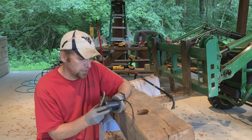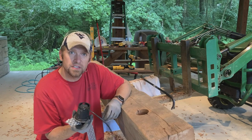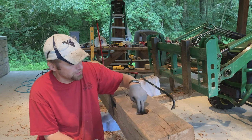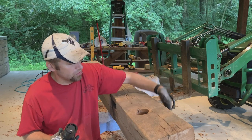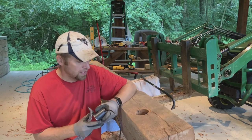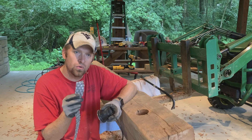These can lights that we bought, I don't know how you're supposed to anchor them in the recesses. So what we did is we drilled a 3-inch hole, which is what sits on this lip. And then there's a hole out the back for the wire to come through, but it needs something cushy to kind of hold that in there.